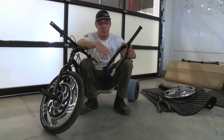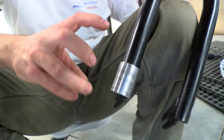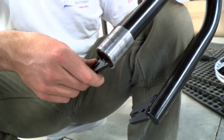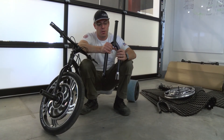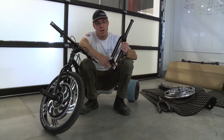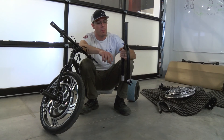So that means we're having to redesign the brake caliper mount, because the offset on these is just a little bit different — the way they're actually welded onto the fork is a little bit different. What I've been working on today is making a new dropout doubler on the back and then hopefully being able to reuse the same brake caliper mount.